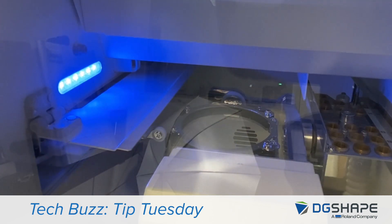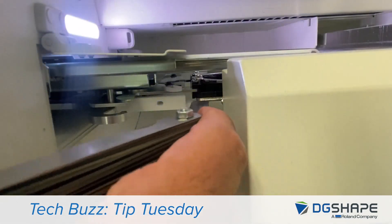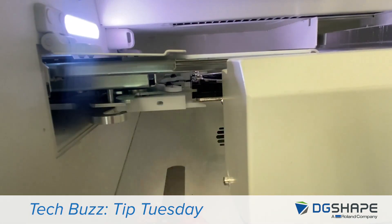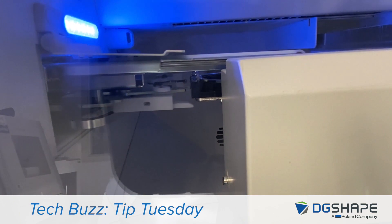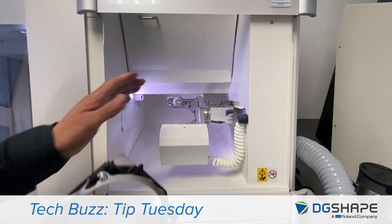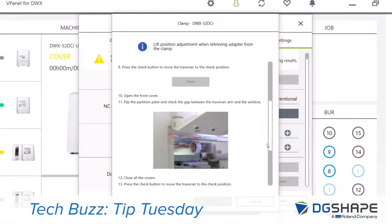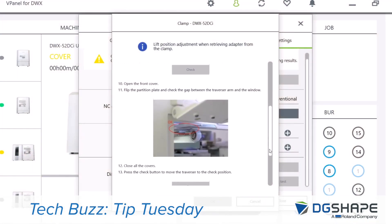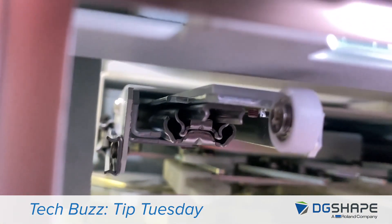Place the adapter into position. The device will now move. We will check the gap to make sure it is within 0.1 to 0.9 millimeter. The device will return — make sure to remove the adapter. We will scroll down and check to make sure the traverser arm and the window have sufficient space and there's a gap in between.